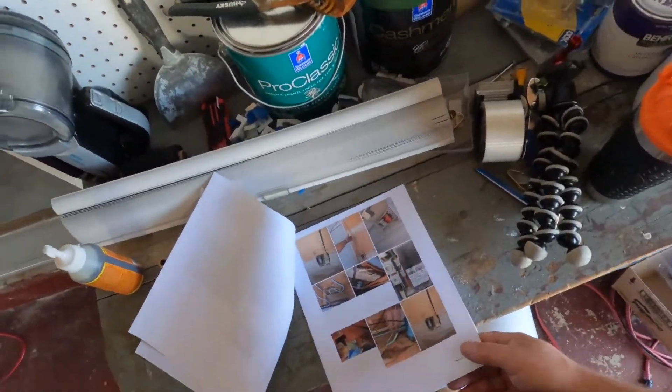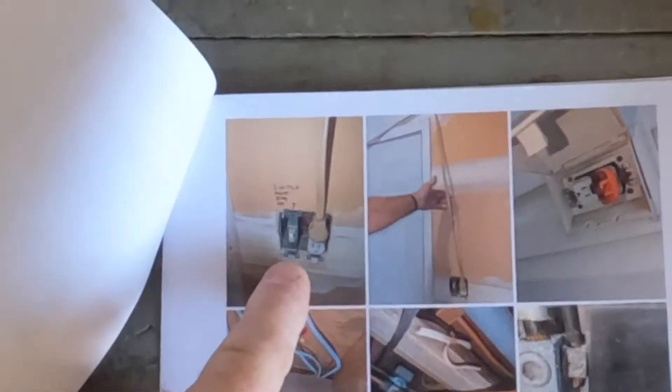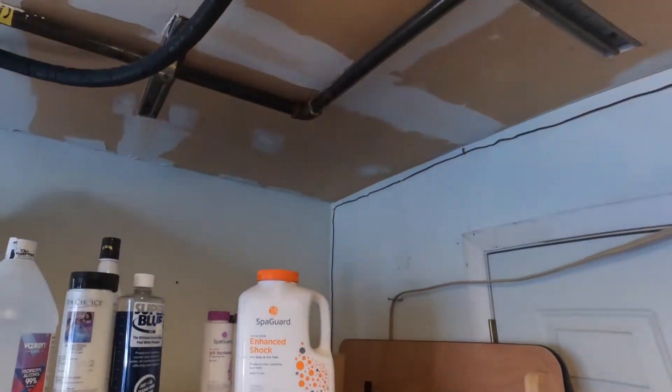The main thing I'm looking at right here right now is this extension cord that is plugged into this receptacle over here, which is fine, but it's powering this refrigerator in the garage. If I unplug this extension cord, you can see that it just comes undone — so we can't use an extension cord for a permanent means of wiring.